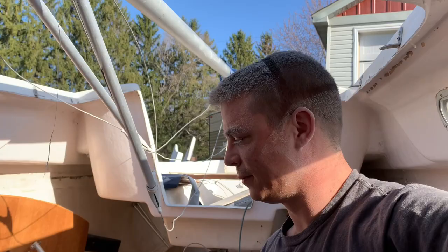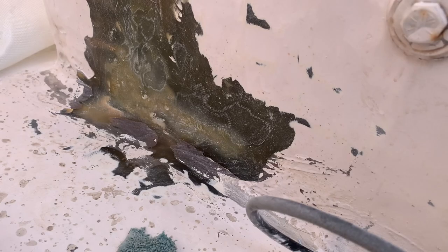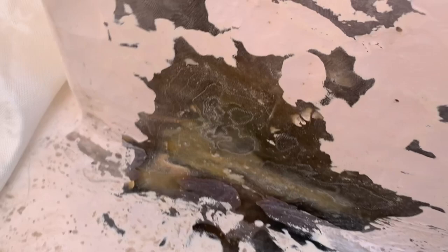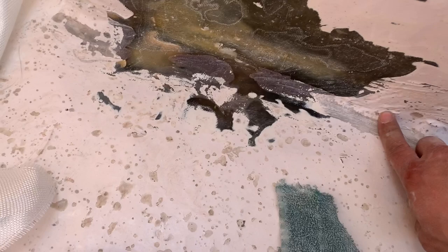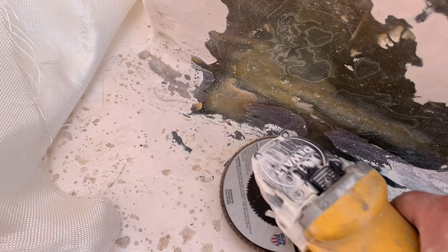Yeah, it's a good thing that I got it nice and clean before I decided to take a grinder to that soft spot and dig out all that loose soft area. Put some fresh fiberglass in, but it looked like a bunch of peeling crap, and the deeper I went, the deeper it went, and damn, that turned into a much bigger job than I thought it was going to be, but ground a lot down and put a bunch of fiberglass in, and it's much stronger now. Terrible camera work, more playing with this thing than I am doing this stuff, but it went pretty far. This is the bottom corner, so it's up about an inch from that. I'm gonna put my mask back on and get to grinding.